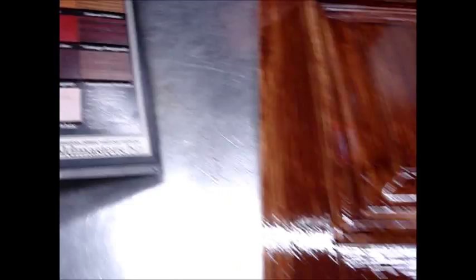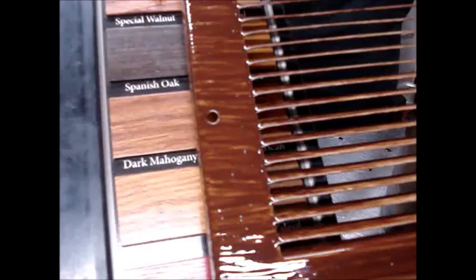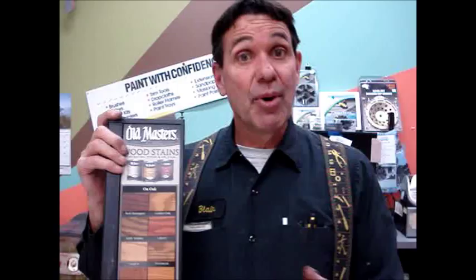When we're choosing these colors, we're doing this project with Special Walnut. Two coats of Special Walnut came out quite a bit darker than it looks like on a piece of bare oak. By putting on multiple coats, we're going to get more color. We can't go lighter with anything, but we can always go a little bit darker. So if you want to take a kitchen and darken it, or take a steel door or a piece of steel, anything in a wood situation that you'd like to blend in, you can see how easy it is to do that. Thank you.